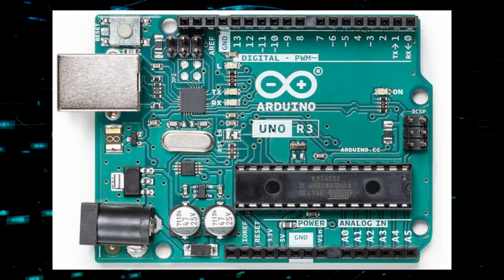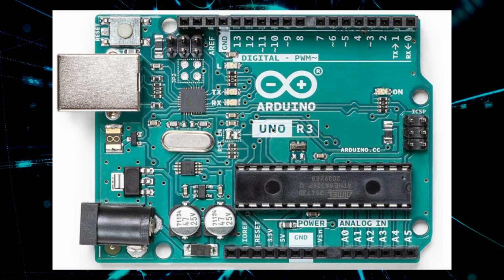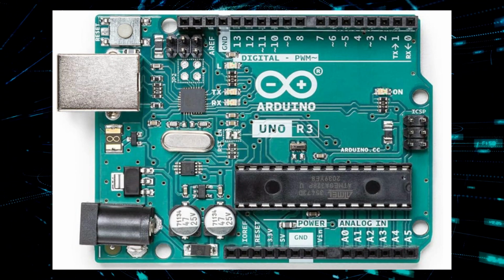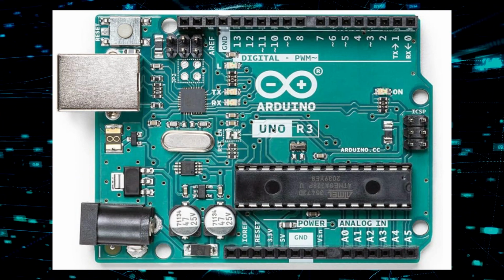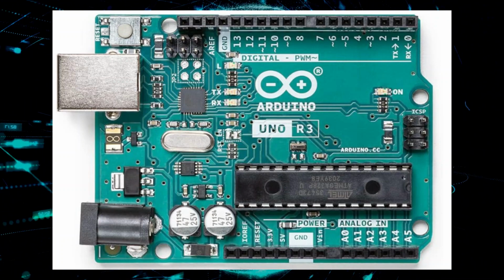Arduino is an open source electronics platform that designs and manufactures microcontrollers and kits to build all kinds of cool stuff. One of the most popular Arduino boards, especially for beginners, is the Arduino Uno. This is a board with an Atmega 328P microcontroller, 14 digital input-output pins, 6 analog input pins, a 16 megahertz ceramic resonator, a USB connection, a power jack, an ICSP header, and a reset button.